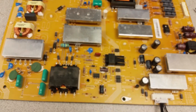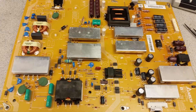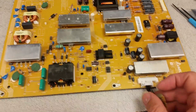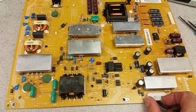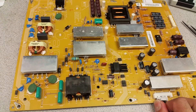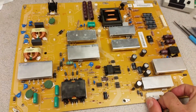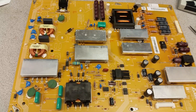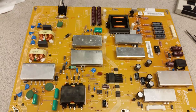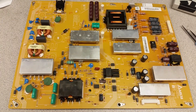The second thing we're not doing in this video: a power supply board is properly tested when all those things we just did are done while the board is actually loaded. You don't just have a simple connector — you have something that actually takes current out of the board, and you verify that the power supply is holding the voltage it's supposed to hold when you start pulling current out of it. We don't do that in these test videos.